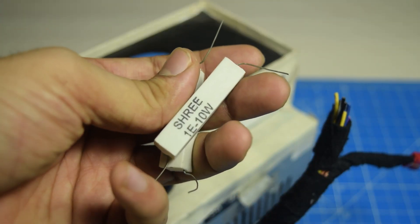I came to know that this power supply had feedback only from the 12-volt rail. Whenever I drew current from the 12 volts, the controller would know and increase the voltage across all the different outputs. This was a big bummer. I would have had to add dummy resistors, which would get hot and require heat sinks — a whole other messy situation.